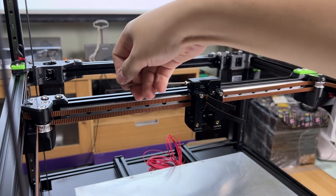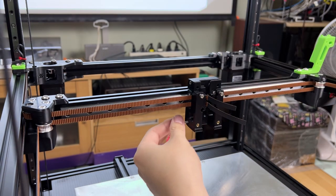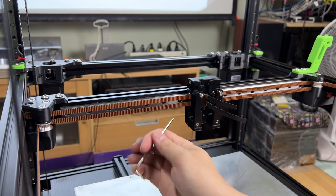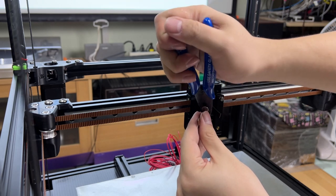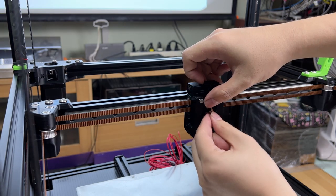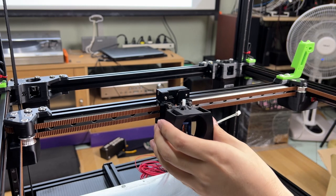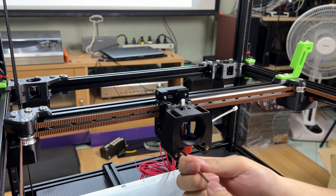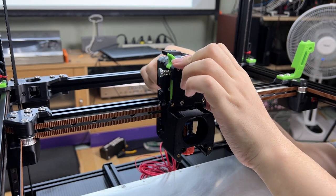You should try to make the belt loops as equal in length as possible before cutting the ends off, to make sure the tensioning of the belts is equal. Now I'm test-fitting the printhead parts to make sure that all parts fit together perfectly, although the actual wiring has not been done yet.